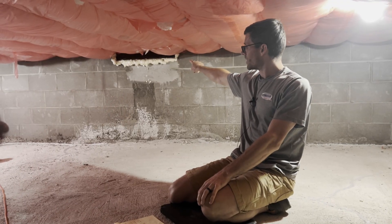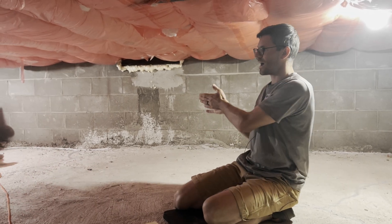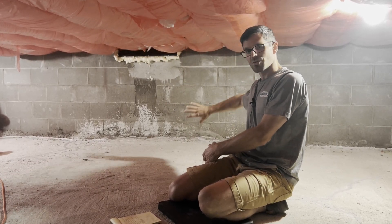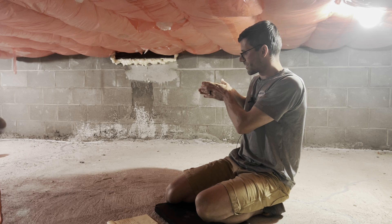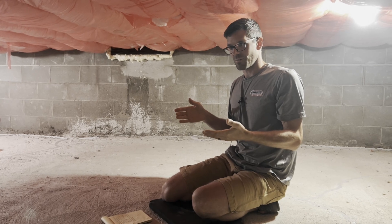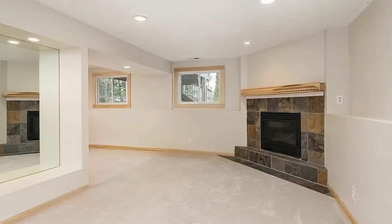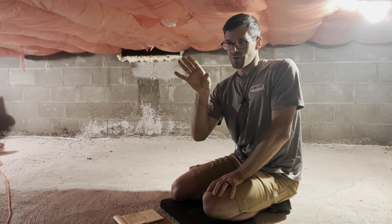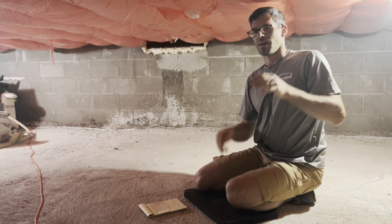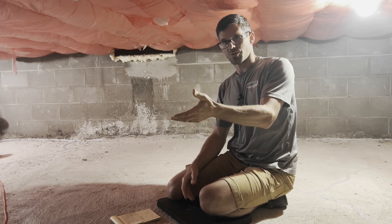If I'm coming out where that spray foam is somewhere from the garage into here, I could put a suction point over there. However, if I'm doing that, I'm probably going to get some collateral mitigation — I expect to find sand below the slab here. I'm going to get some collateral mitigation into that garage area, meaning the radon system is going to create negative pressure under that footing and mitigate at least part of the garage. I probably don't have to treat the garage to drop the radon here. So if I'm going to get collateral mitigation somewhere, I'd rather have it be to the indoor space — get that main part of the living room and go under this footing. I'm going to run some tests and see: when I apply suction to a half-inch test hole right here, am I going to reach any of my other test holes? That would be a good indication that this is a good spot to use as my primary suction point.